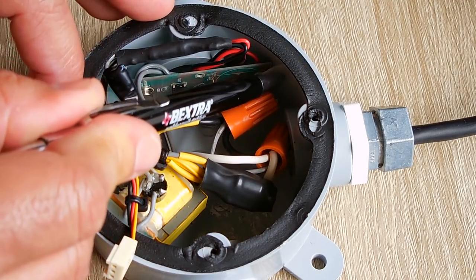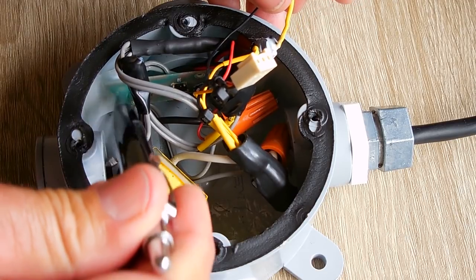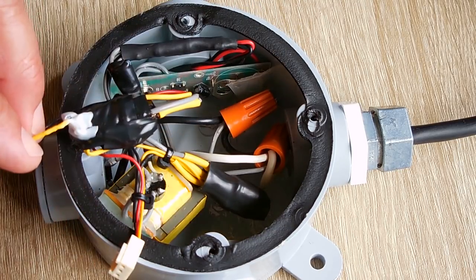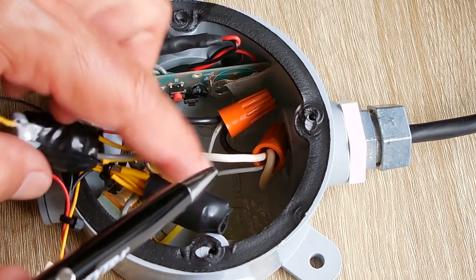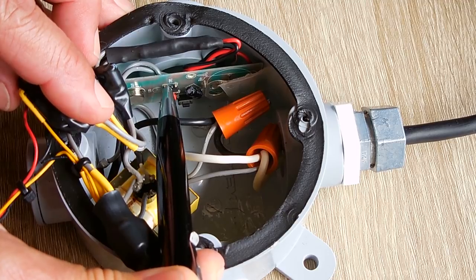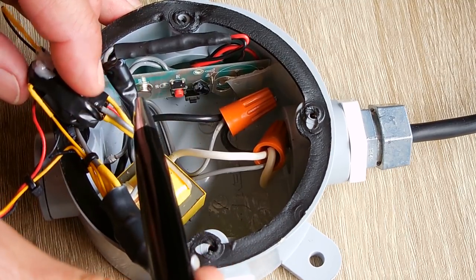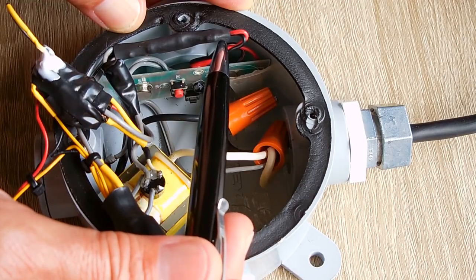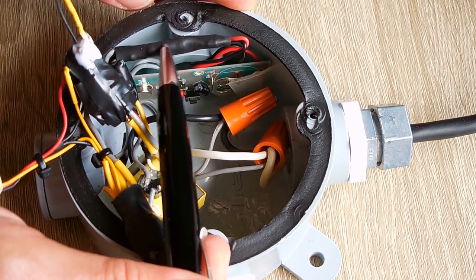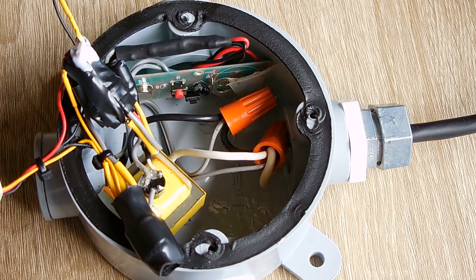The transmitter board is being held in with Flex Seal tape — it does not move. It's very strong, sticks well, and both sides have the tape. The transformer is siliconed in so it can't move. Wire nuts over there, and the wires for the push button on the transmitter — I took each pin, soldered a wire to it on the back, and that effectively bypasses the push button switch. It goes to the circuit as shown in the schematic. The red and black wire goes over to the battery. In here is that Zener regulator circuit with the resistor, connecting to the spots in the battery holder where it would be positive and negative — just solder it to the back of the board.